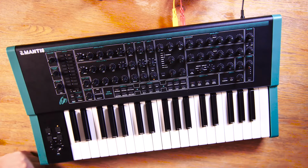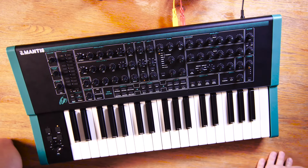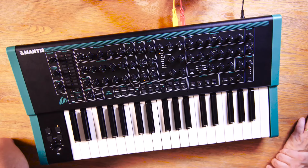The analog staging in this and the chips that we use, which are of Chris's selection, are called Sound Semiconductor Incorporated, I think. Yeah, they're SSI. The 2164s. And we have 3 chips in there. They're quad VCAs, and those are just beautiful. Absolutely beautiful for doing the filter drive and the gain staging. It's all done through that. That's why that sounds so damn good. It has so much presence to it. Awesome.